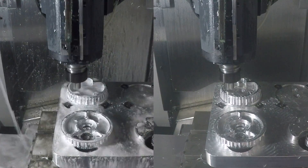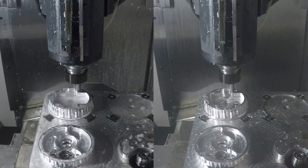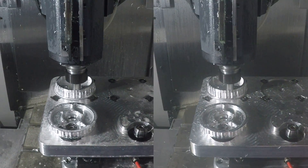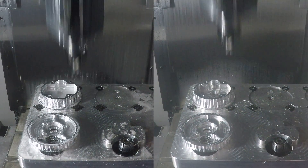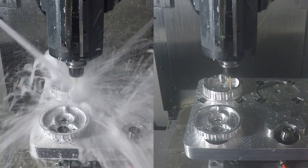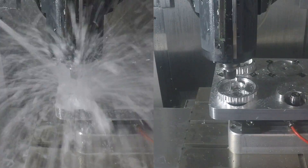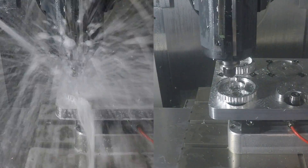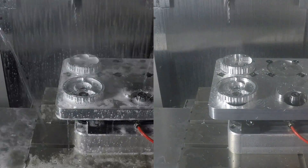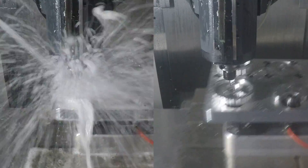And we're facing this with a 3/4-inch 5-flute Swift Carb AF-5. And we're drilling these holes, which will be tapped to 4-40. A little chamfer on those holes, and this is the 4-40 tap.